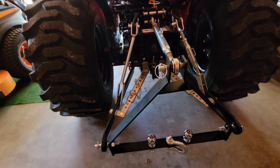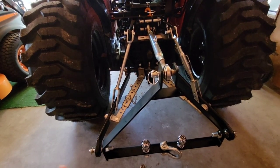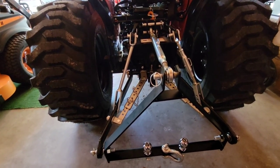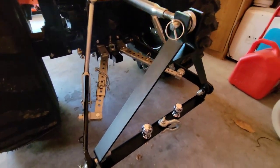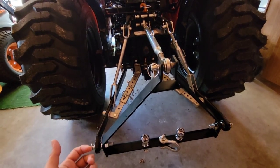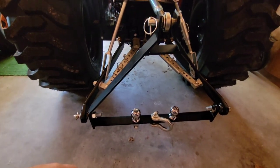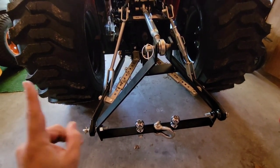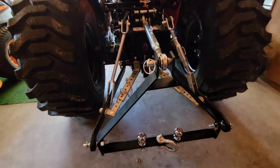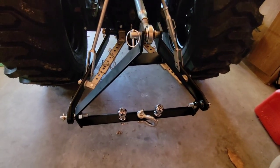The thing I've got to be cautious of is how much weight I'll be loading on it. This system back here can support a little over 900 pounds, so I want to be careful I don't hitch up to a trailer that's too heavy and damage the system or go well over capacity. Very, very cool system — pins in place very quickly. You don't really need a quick connect for something like this since it's so lightweight, probably about 40 pounds. The only negative I'd heard was that if you're hitched up and turn too sharp, the A-frame might bind with the other ball, but I can't imagine really being in a situation where I'd need to turn that sharp. Looks really good so far — let's go check it out and see how this thing works.